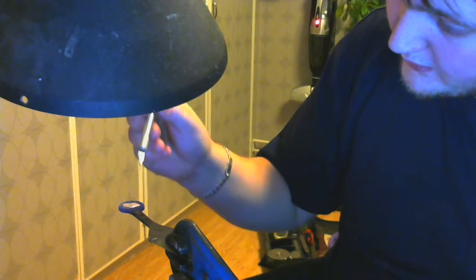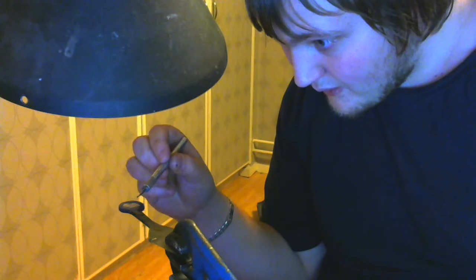We're gonna get a thick layer of slag on here. It's like a fine, yeah, you can see it. Nice. It's like a fine glass bead on the end there. Managed to get rid of it. Nice. Okay, so we couldn't braze pure copper onto there, but we could do silver solder.